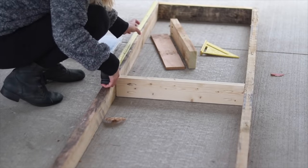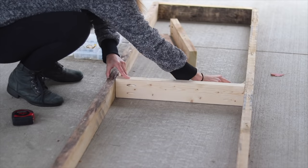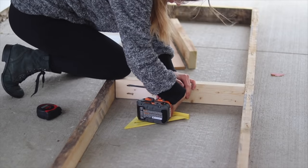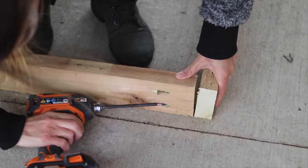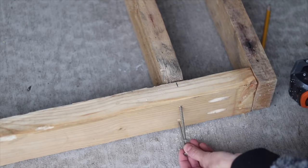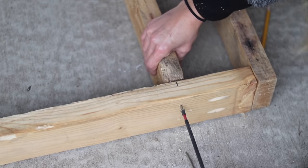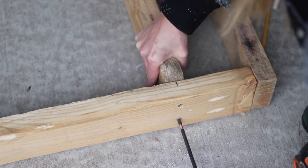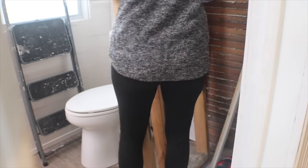I'm going to be framing up this wall on one side to basically determine the depth and the width of this closet, because it will look like it was meant to be in the corner of the bathroom and not added later. So it's going to be about 22 inches deep and 21 inches wide. Because of that I'm adding another stud between here, since studs are supposed to run every 16 inches to support the drywall, and I ended up staggering support studs between as well.